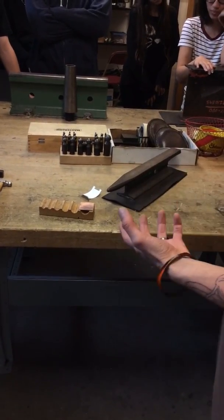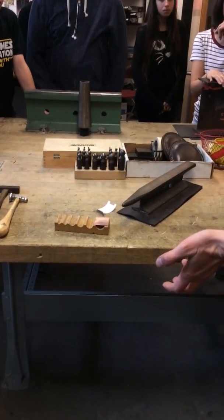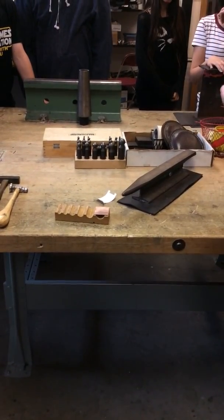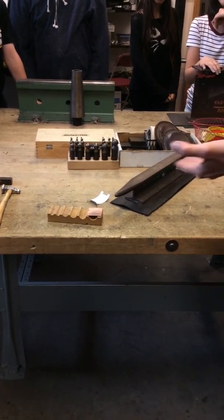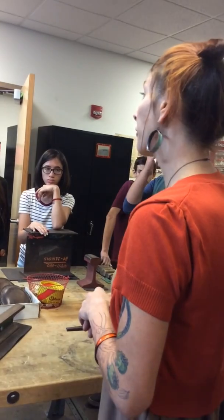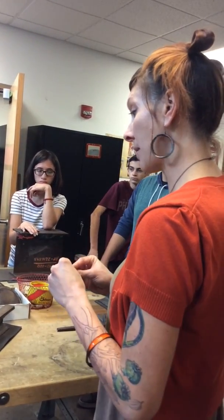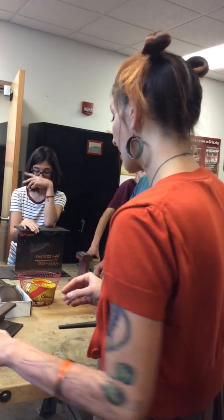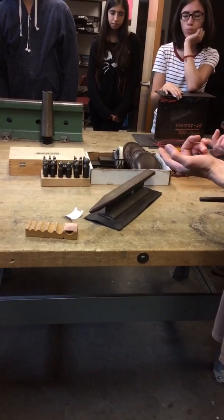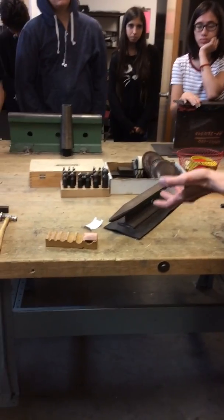You guys all made rings, so you all made a cylinder already. It was just a short stubby one. So just know that before it's attached, in whatever method you're attaching it, it's not going to be fully round. By making that connection, either riveting, tabbing, or soldering, you can always slide it back onto the tool that you're using to really shape it round. It doesn't even have to be round if you don't want it to be. You can make it any shape you want.